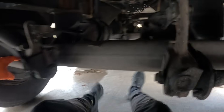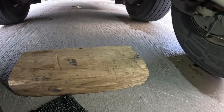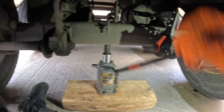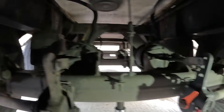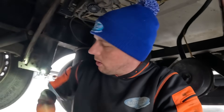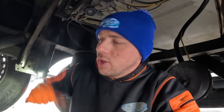Let's get under here. We only need to jack up the middle axle because the middle axle is the only one that has sensors coming down the pipes. On this trailer anyway — other trailers are a wee bit different — but this one only has sensors in the middle axle. So we need to jack that up so the end-of-line test can detect if the sensors are reading.